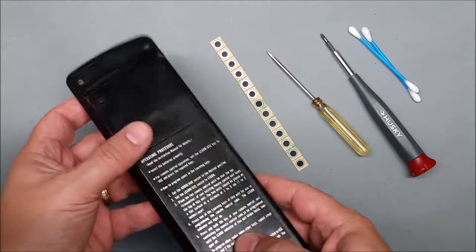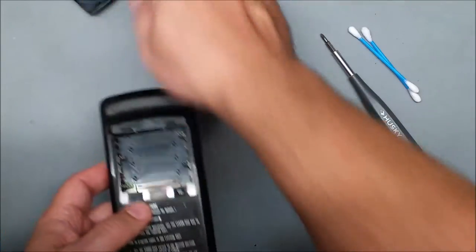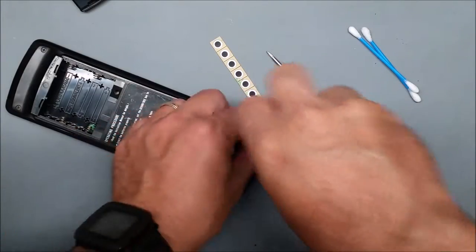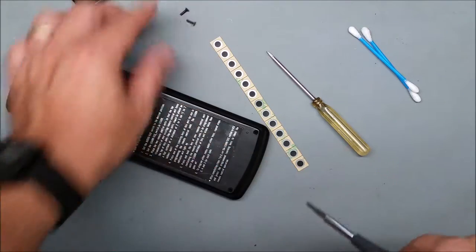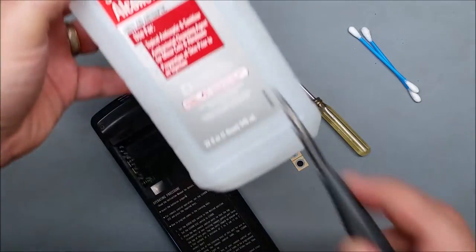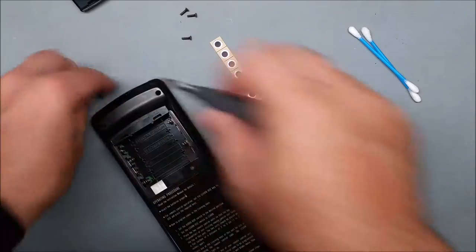To get it open, there are four screws. Take the batteries out of the battery compartment. There are four screws in the corners requiring a small Phillips screwdriver. You'll also need a small flat screwdriver or some sort of flat tool to help pry it open, rubbing alcohol — isopropyl alcohol. I like the 91% — 70% is okay but has more water.